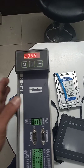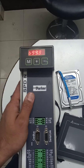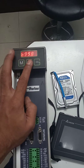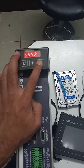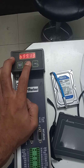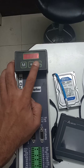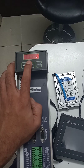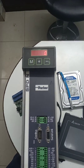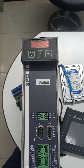If you do not save, the parameter will not be retained after powering off the drive. To save the parameter, go to parameter number 99.15 and set it to 1. You can see 'done' appearing on the display, which means the parameter is now saved to the drive. In this way, we can set auto reset of the under voltage alarm on a Parker drive.